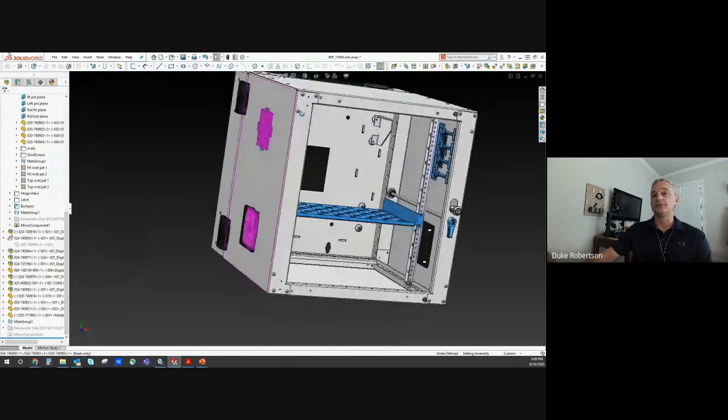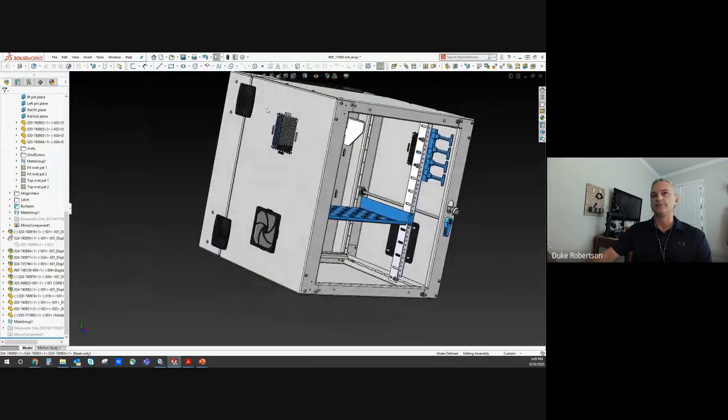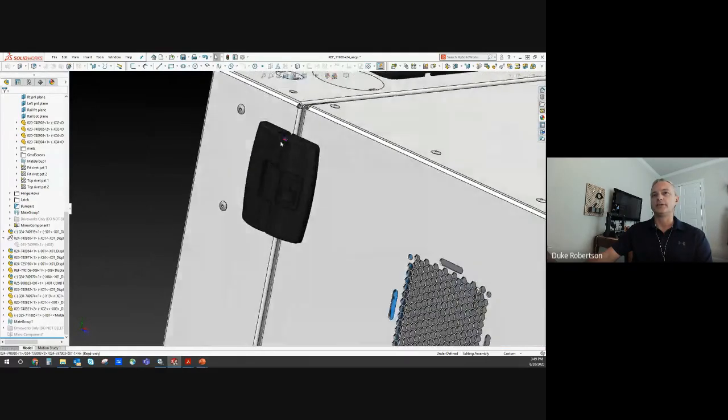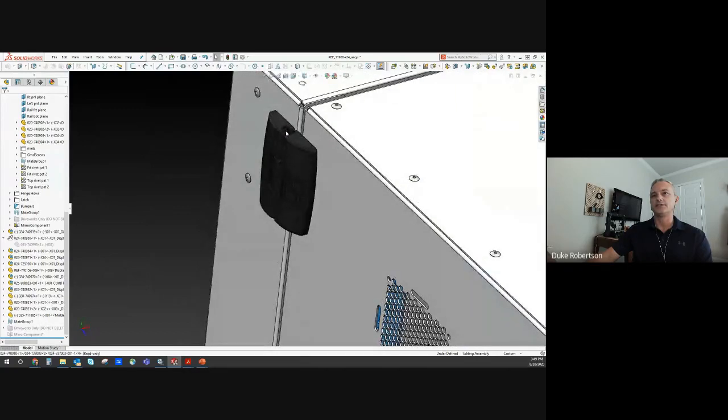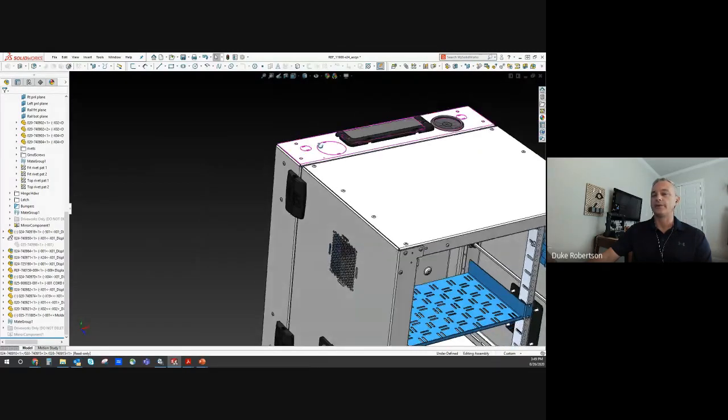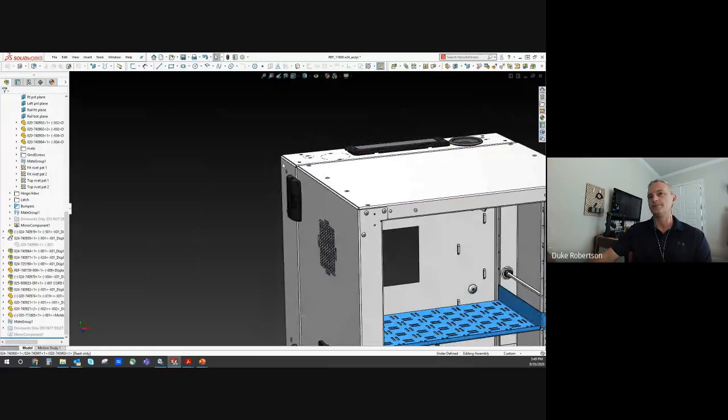If you need to remove, especially during the initial installation, you need to separate this rear section from that main center chassis. These hinges are split, so there's a hinge pin inside with a set screw. You just remove the hinge and separate the 2 halves, and that's how you, on day 1 of the install, would mount this rear panel to the wall first, and then attach your center chassis.